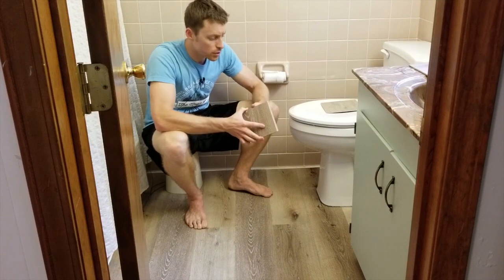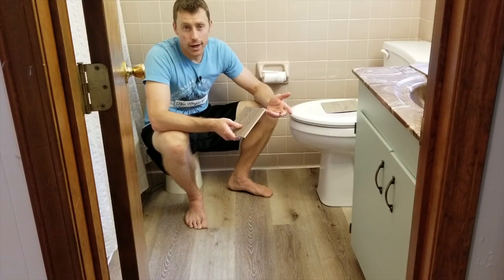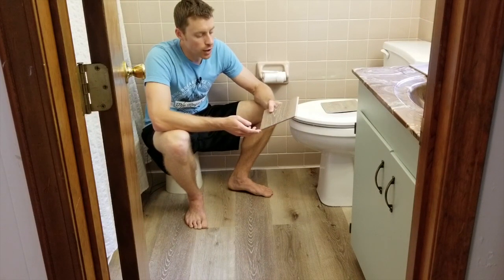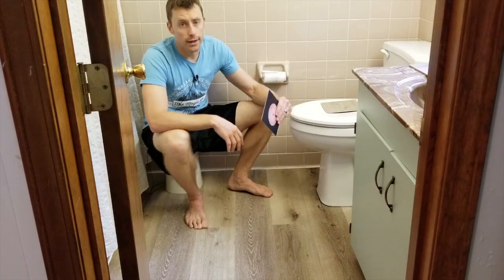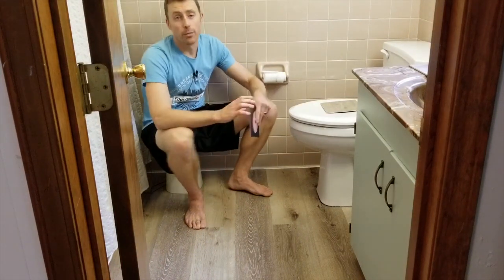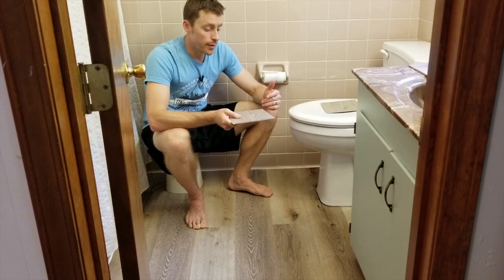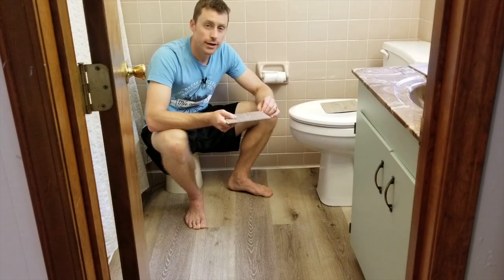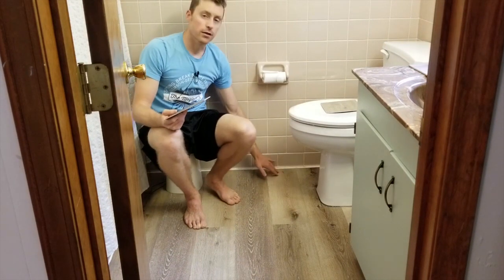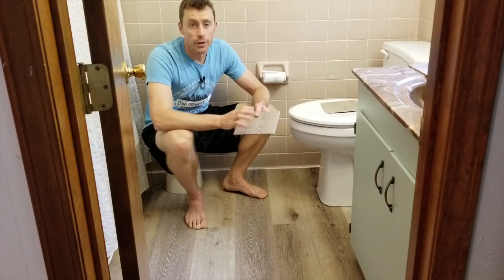Because this is limestone, it's very heavy. A box contains 10 pieces and is very heavy — in fact, the guy at Lowe's got the dolly to move it to my car. Because of that, you've got to be careful about the edges. If you lay a full plank on its edge, you will damage that corner, and when you install it, you're going to notice it. I actually had an entire box delivered where the shipping company laid it on an edge, which damaged every single edge on that corner in the box, making the entire box pretty well useless. If you have one damaged edge, you could use it at the end of a row and trim it off. So be careful about the edges.